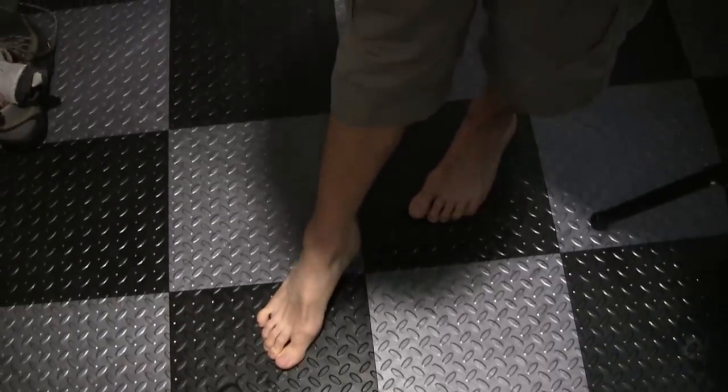When working on an electrical system, the first thing is to have it de-energized, and hopefully have a buddy or someone nearby. I happen to have my wife working at home today, so I've made her aware I'm going to be working on an electrical system. Ideally that buddy is nearby within earshot — if you suddenly yell and have a problem, they can come and assist. Now, assisting someone who's being electrocuted can itself be very dangerous. You mustn't touch them; you need to de-energize the systems first before pulling them away. Also, don't work with clammy hands or in an environment where there could be water or chemicals on the floor.